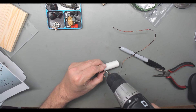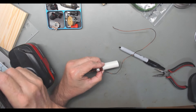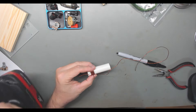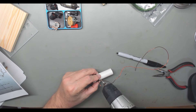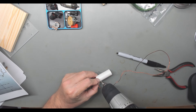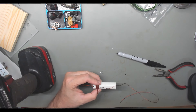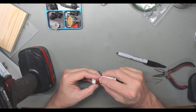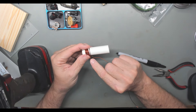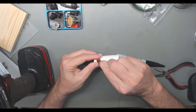Hopefully I don't have to worry about the drill tearing up the enamel off my wire causing a short. Now that I've got that hole, I'm going to go ahead and make another hole, come back up through and out. Now let's get back to our 15 windings. That's 12 — this tap is 12. So this is 13, 14, 15.